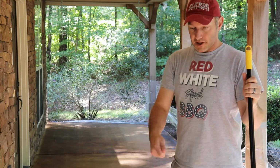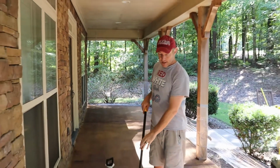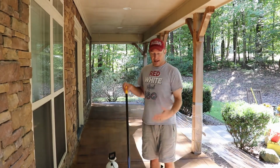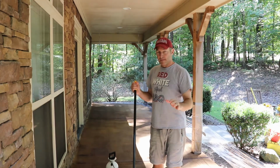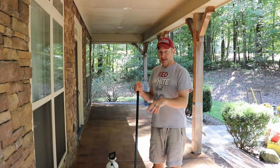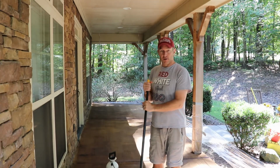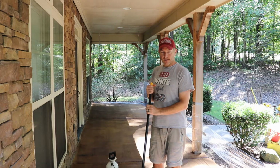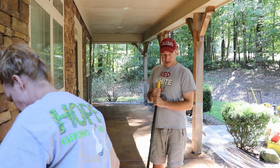So what we're gonna do is we're gonna spray this just like we sprayed the acid. Then I'm gonna come behind with the broom, and I'm just gonna push it back and forth. I'm not gonna put any downward force on it. I'm just gonna let it kind of help pull that residue off, because we wanna deactivate the acid, but we don't wanna pull any up. So if I scrub real hard with this brush, I could potentially pull some more of that acid out of there. So let's go ahead and get this thing sprayed down, get it cleaned up, and then we'll start getting it hosed off.